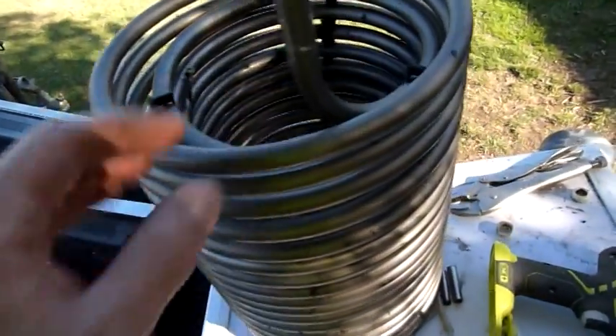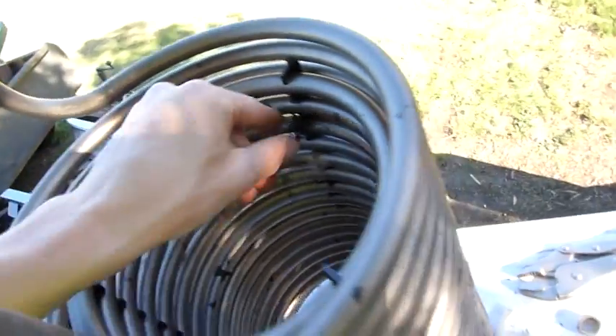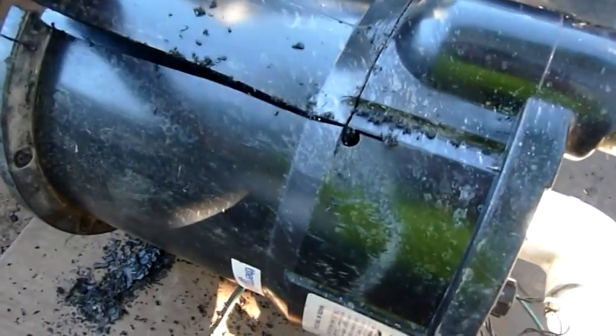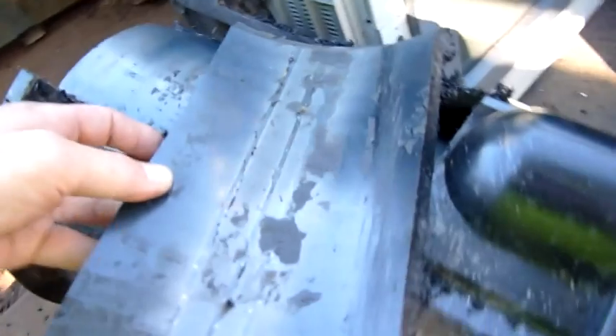I ran out of daylight yesterday but resuming again today. After getting the coils out and also talking to Terry at work, I found out this stuff here is the plasticiser from the PVC extrusion. It has a nasty habit of making PVC rigid pipe very brittle. So he knew from the start that this heat exchanger would be doomed, and more than likely that's what's happened. There's a nice fracture going all the way through there and it keeps going up. Ice may have also been part of it, but look at these cracks — it's where the adhesive has spilt on it from when they glued the thing together. It's picked that as a key point to attack and really got stuck into it.